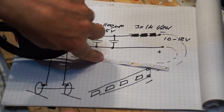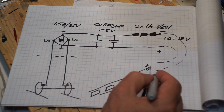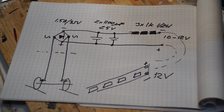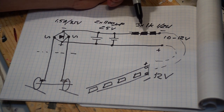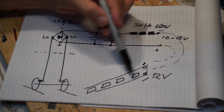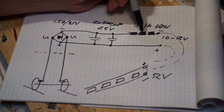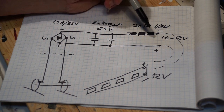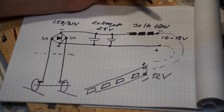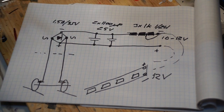This is the LED strip — pay attention to the markings on the leads for positive and negative. This strip needs to be rated 12 volts. I have the three resistors installed, and the only reason is so that once I build my working prototype I can move the lead between the three resistors to find the preferred brightness. I'll start at one end and move the wire to see which position gives the best illumination. If you know exactly what value you want, you can go straight for a single 3k resistor. Right now my lead is connected at the second resistor — it's just a convenient way of playing with the brightness.